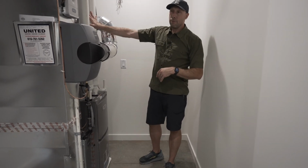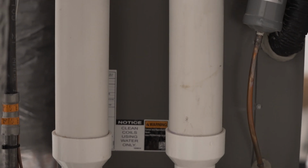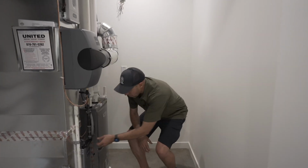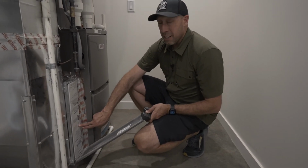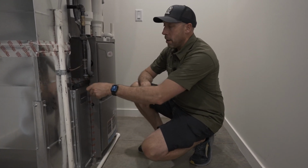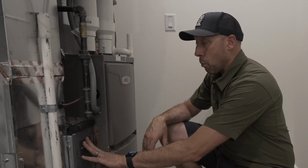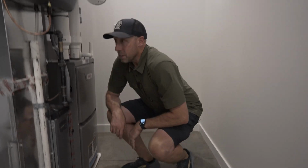So, of course, these are high efficiency units. We're ducting that flue gas out of the house and through the concentric, drawing in the makeup air for that. We are using a MERV 11 filter to make sure that we are delivering as clean of air to our occupants as we can. This would actually take up to a MERV 13, but there are always concerns about limiting the flow. The more you filter, the more you reduce flow. So we're very comfortable at 11 and 13, but that's the filter we've chosen for this at this time.